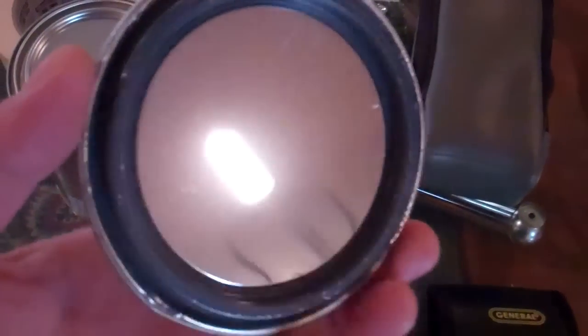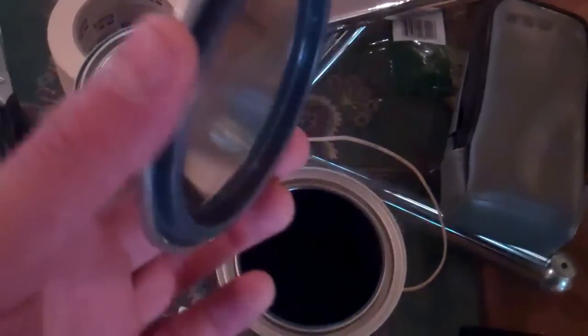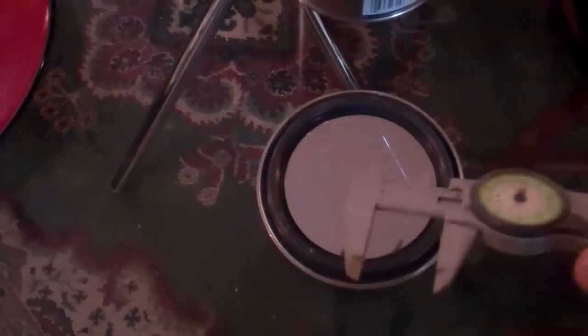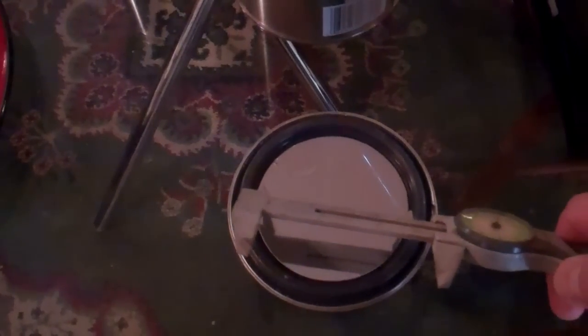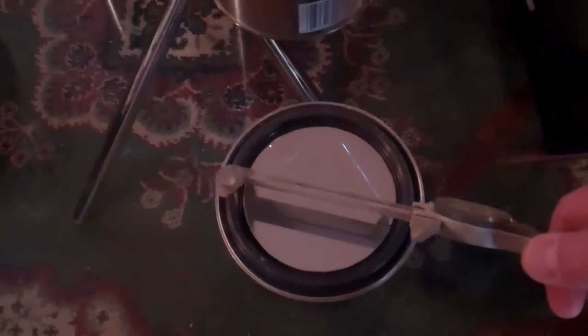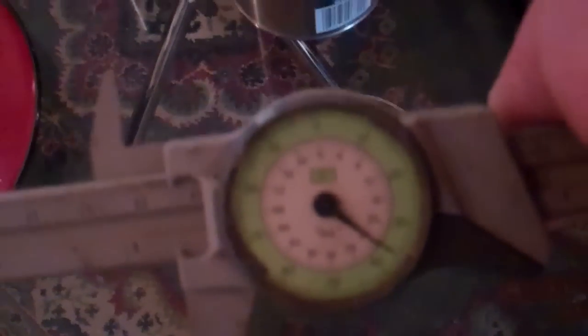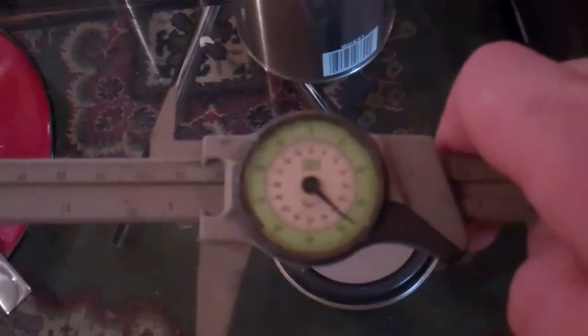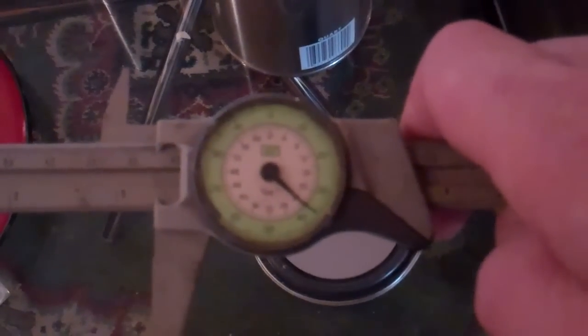This is the back side that's going to be in the can when the capsule is used for directionality, so the outside will be the sound field surface. We're going to need a back plate behind it, so we'll measure exactly the diameter — as closely to exactly as we can — with a cheap caliper. We come up with 3.37 inches, so we're going to cut a circle of 16-gauge steel just a little bit smaller — a couple thousandths smaller than that size.